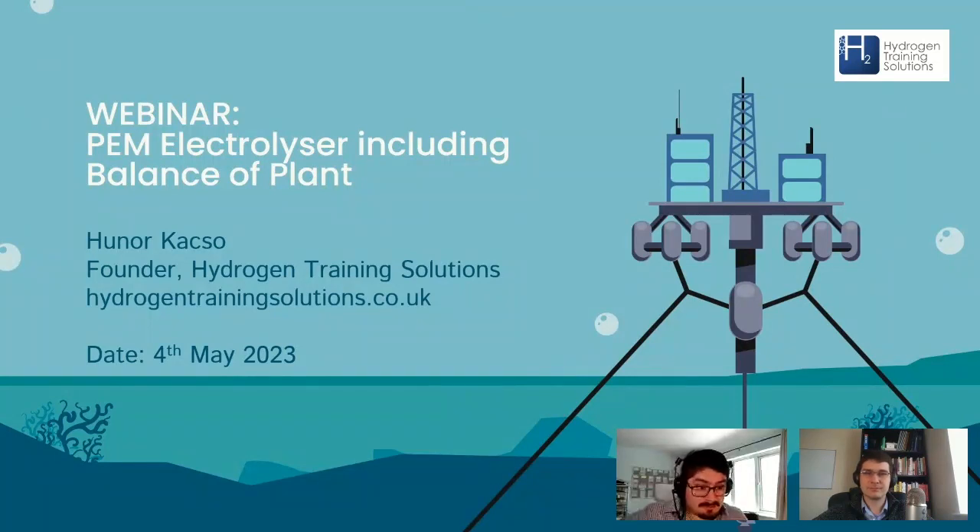First question from Mr. Semri: manufacturers include kWh per kilogram stack efficiencies — isn't kWh per kilogram directly related to the electrolyzer operating voltage? Nominal operating voltage varies between manufacturers, but the maximum capacity of all of them is around 2.1 when calculated from catalog values. Don't you think nominal kWh per kilogram values are misleading? About two thirds of the cost of running a PEM electrolyzer is directly related to electricity costs, so yes, it can be misleading depending on how you define it.